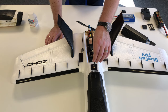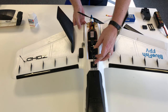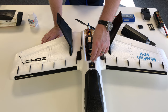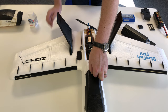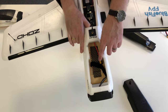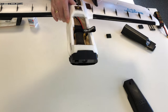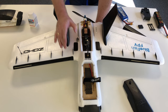The only other thing on the top is the VTX mount — where the GPS cover normally goes, I wanted to use that space for my VTX mount like on version 1, so I made this simple 3D printed mount. It's lightweight and drops in there, allowing me to mount my VTX antenna centrally on the plane. Inside the battery bay, I always use this anti-slip matting — I bought a big roll and cut it to size. When you put a LiPo on top of that and strap it down, it really doesn't want to slide backwards and forwards, which is important to keep the center of gravity consistent and avoid any sliding during acrobatics.